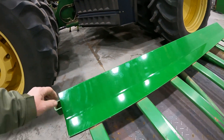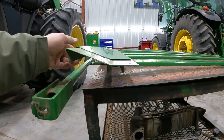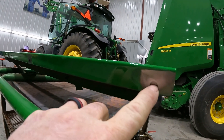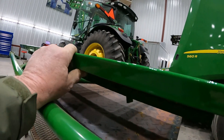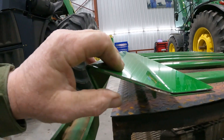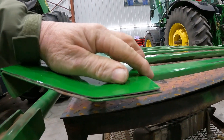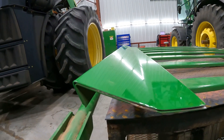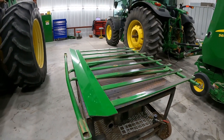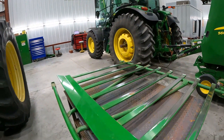We'll clean some portions up and use a MIG welder to weld this new insert in. Keep in mind you don't have to cut the original insert out — this will lay right over the top. It's got some holes on the back side where you can make a pretty good weld to hold it in place. You'll want to use some vice grips or C-clamps to hold it down and take all the gaps out of the two pieces of metal where they fit together. We'll get this net pan support back in good working condition and install it in the baler.